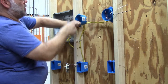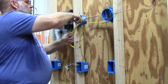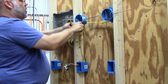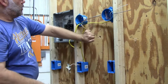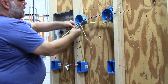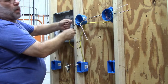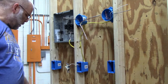Make sure you don't cut into the white or the black coating, so be real careful when you strip your wires. This wire is my switch leg going to my switch box - clean it off, get rid of the paper, fold it out of the way. This last wire is my hot wire coming from my panel box. This may not always come from a panel box - it may be coming from another outlet or another light, but it is the power in. So I have power into this box.